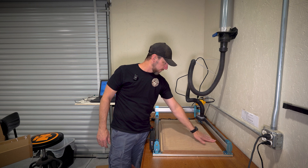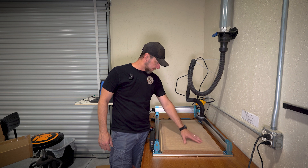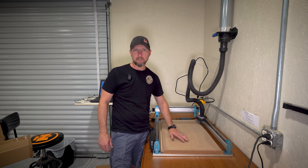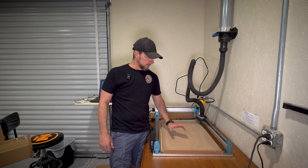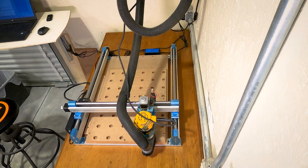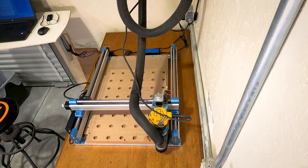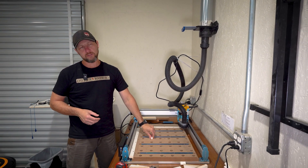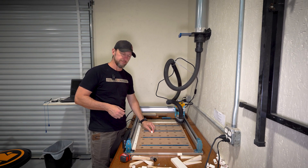With that all flattened out, I've still got a little low spot over here — you can hear it just barely touching but it didn't cut anything. I'm not really worried about that because most of our work is going to be done down here anyway. Now I'm going to go into Vectric and lay out a bunch of dog holes. I first only ran the dog holes a half inch deep into the spoil board, but they didn't seem strong enough, so I came back and ran them another quarter inch down into the subplate to make them more stable.